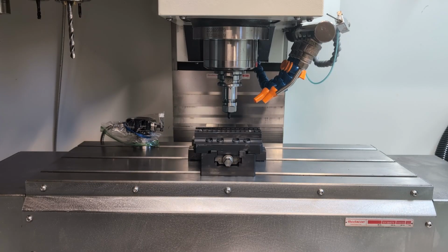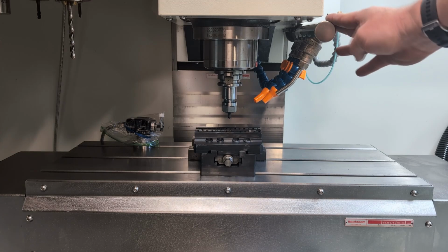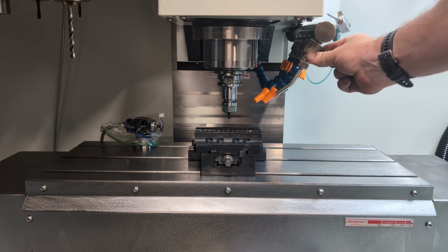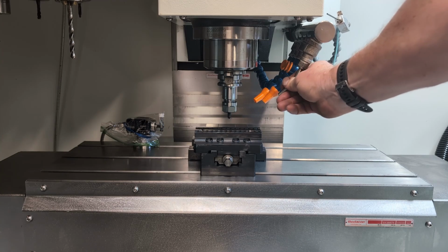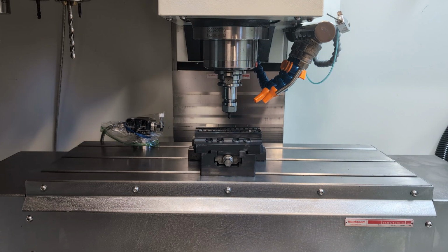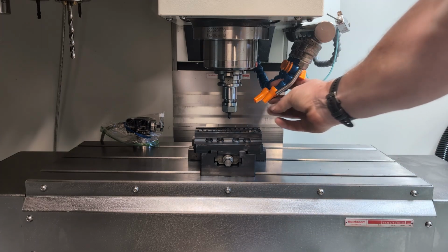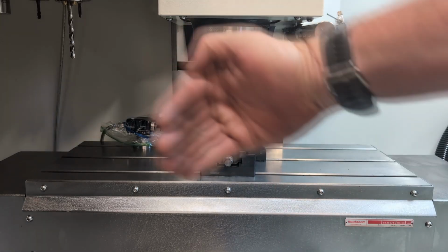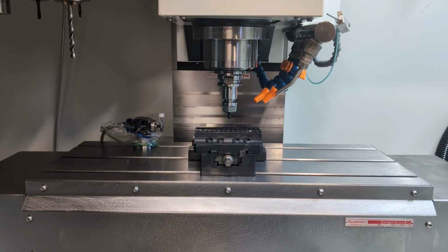The last thing on my list is the machine setup, how I've got it set up in here. So stock, I got this coolant rail right here. It has 3 ports for 3 Lock-Line hoses, and then it has this coolant jet that is adjustable. I fiddled and fiddled with it. I had so much Lock-Line, and well, anyway, I wanted to come up with a good solution to directing the coolant. In this case, I'm trying to direct it all one direction, to the left and this way and towards the front of the machine for coolant evacuation. Again, I might change this down the road, but this is what I have.